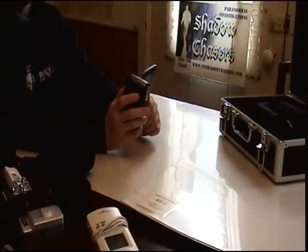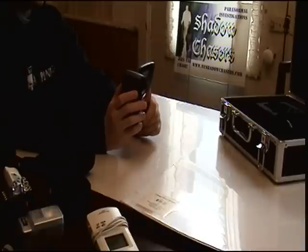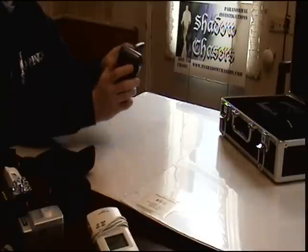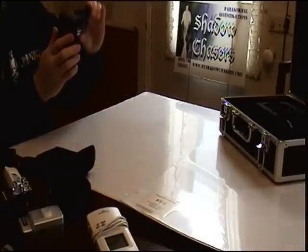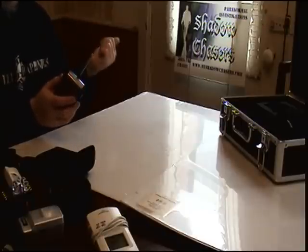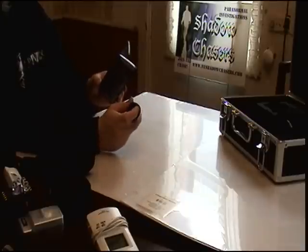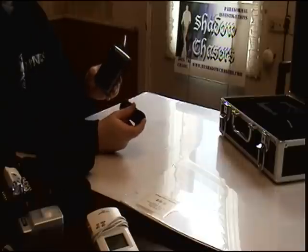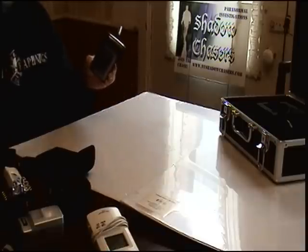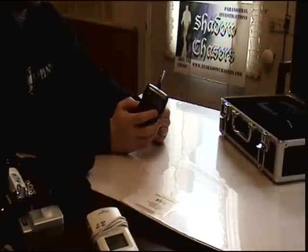The black lights — you can usually see quite a portion of the lighting. Meanwhile with IR, you can only see the glow of the LEDs or diodes. In IR mode with the IR illuminator, you can see a lot further simply because they are designed for wide photography and wide videography at night. A black light is designed so that people can see how things change — like UV flashlights for the southwest where you can see scorpions. So a UV flashlight with this only offers a limited little profile — almost like tunnel vision — because everything outside that concentrated spectrum at the center of the light, this camera will not pick up. If you shine a flashlight, especially an LED flashlight, straight at this thing, you will see nothing.